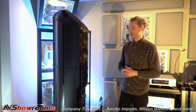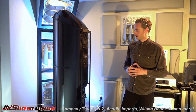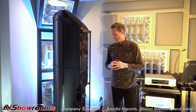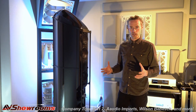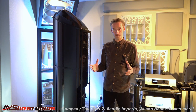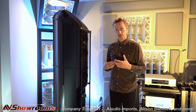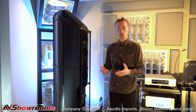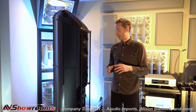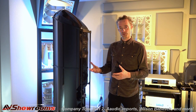It's quite a unique implementation of drive technology. All of these drive units are built in-house — a relatively compact 7-inch woofer. In the isobaric loading, we have a push-pull drive formation, which is quite unusual. This is essentially dividing the load by two. Rather than having a large woofer, we have two woofers with equal pressure — isobaric means equal. We're dividing the load of the low frequency, which is the most difficult part of the recorded piece to convey in terms of energy, giving a very low resonant frequency that allows the low frequency information to be conveyed accurately.